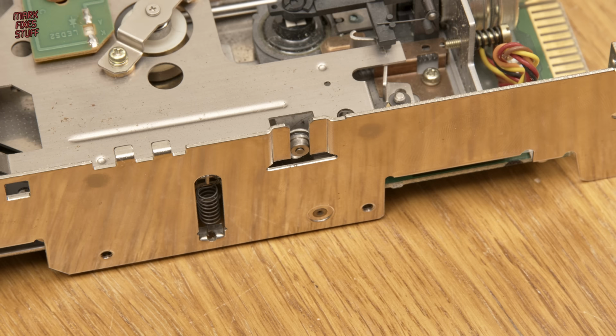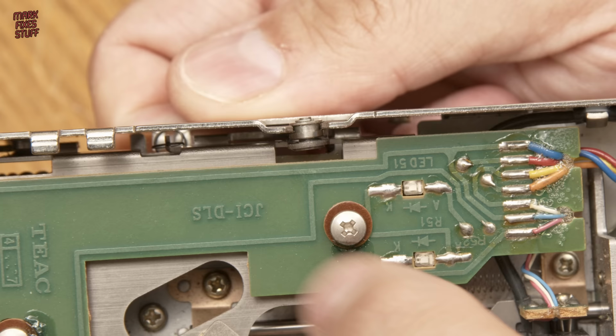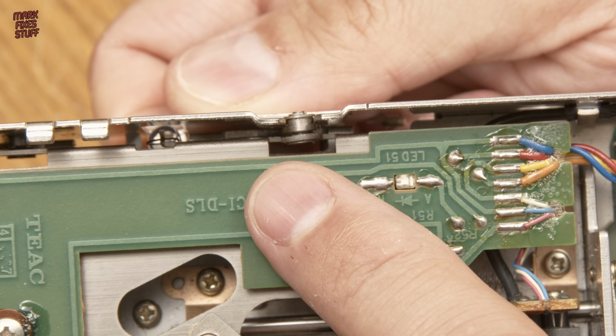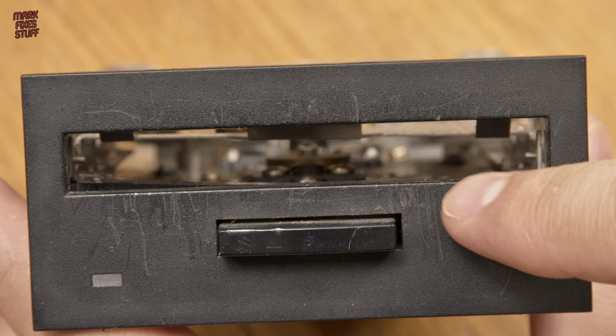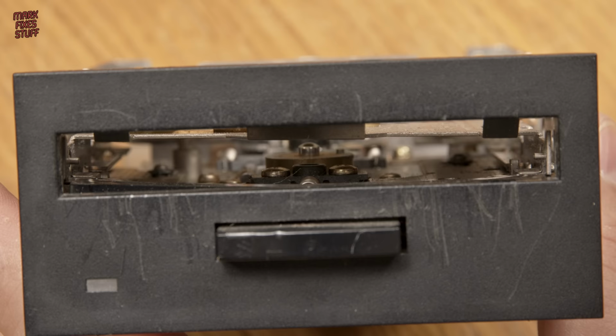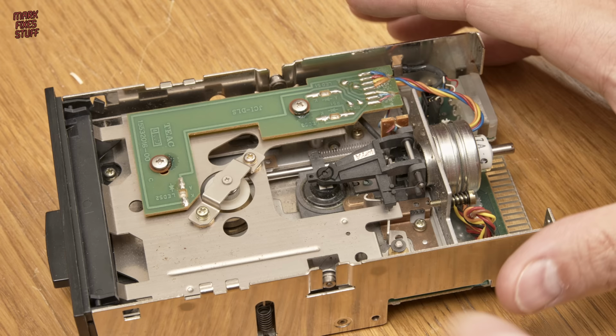Trying to square up the runners actually made them a bit worse. In my experience working in a manufacturing environment with drives, bent drives never worked well and they ended up jamming a lot. It's not looking good, fixers. We can see here evidence of the many levering attempts and just how off-level the internals of the drive really are. With all this in mind, I think that this drive will be unrecoverable.